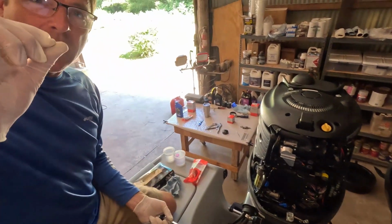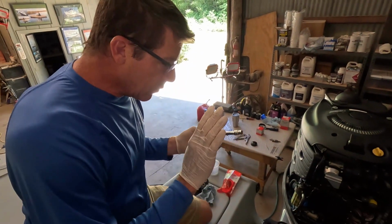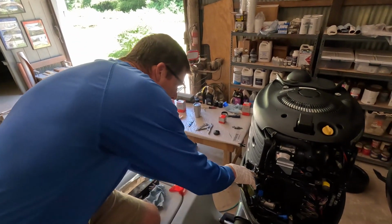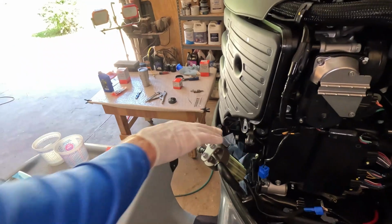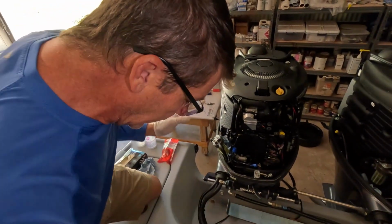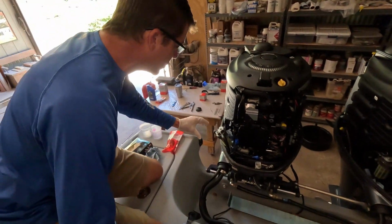Now, it's one thing if you want to use them to remove the parts, but I'm a big fan of starting everything by hand and then running it in by hand, because for example, you've got aluminum components there and it's quite easy to strip out an aluminum thread. So I like good old-fashioned hand tools.